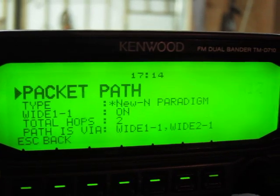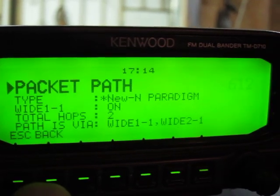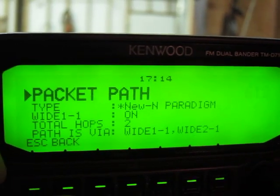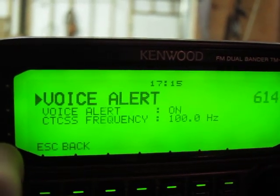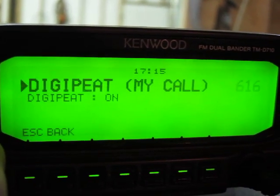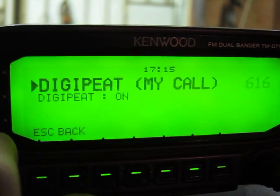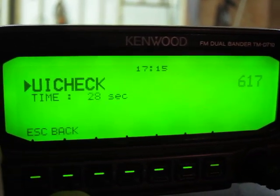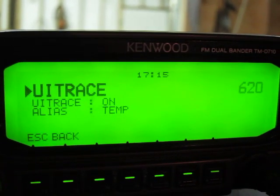Network is set to APRS. Voice alert — I just have the default settings. I don't have a weather station. I have Digipeat turned on. This means that if you receive an APRS call, you send that signal out with your call sign and theirs so that they can get out to the APRS network. These are just the settings for the digipeater, and I have those set to the standard.